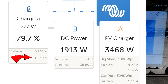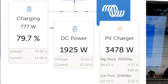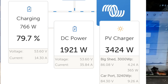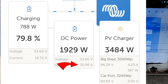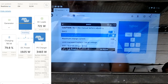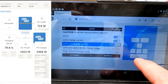Immediately you can see the charge current into the battery goes down to 14 amps only. But why, since we set 50 amps? Looking at the DC power output, we're currently running the Xia inverter with the air conditioner inside the house — a 1.8 kilowatt unit. The air condition already draws 36 amps DC. Add the 14 amps of charging and you get to 50 amps total. So all DC load together equals these 50 amps.